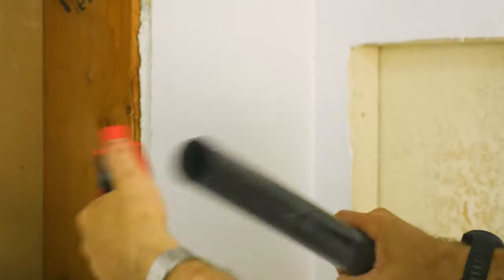Now we've got to pull this wire through this stud. Come back about two inches and cut this out so we can reach in and push the wire through — just a little more drywall repair but not a big deal. Before you do that, make sure nobody turned the power back on. We're good. Now pull it through and push this through the hole here — there it is.